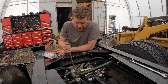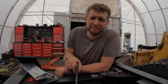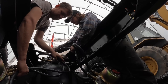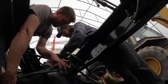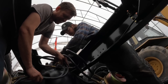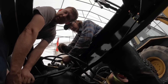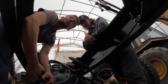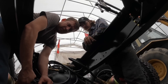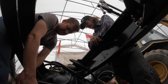I'm doing an eighth of a turn at a time. Making progress. Some jobs aren't glamorous. One thing we're doing here - we're leaving lots of extra room so that if you've got to service it, crimp it, work with it out in the field, there's extra slack in the line. Same thing we did with the electrical and the cab - always a little extra slack so that you can fix things.